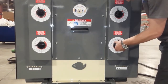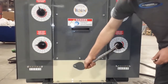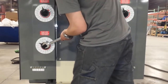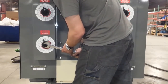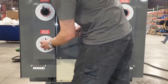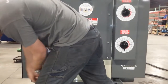You hear a nicking noise, and what you're gonna do is take your pointer and move it back to zero. From there you're gonna walk the roll back out past the 10 and put the pointer right at 10. Then you're going to repeat the same process for the left-hand side. The roll is touching right about zero — readjust the pointer, go past the 10 and put it right at 10.